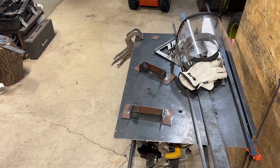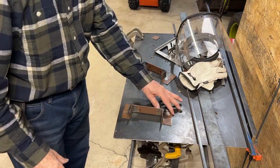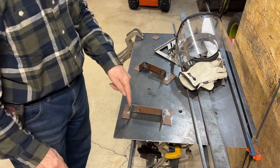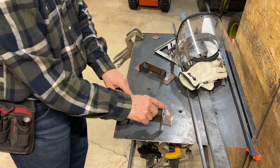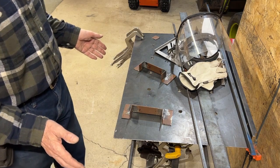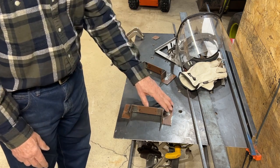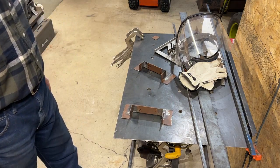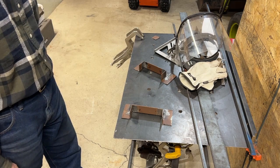All right, my side support / alignment brackets are cut and ready to weld. I was originally planning just a flat piece that I would cut the edges, cut the ends, or bend them over, whatever, probably cut them and weld them. And like I said, I didn't have the 1.5 inch stock that I thought I had, or 1.25 inches would have been enough. All I had was 1 inch. So I got this angle iron, which as it happens is a chrome moly, which makes it a little more difficult to cut, and I'm going to have to drill some holes in these pieces here.